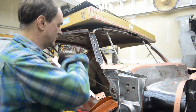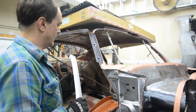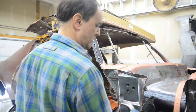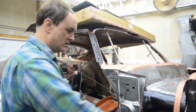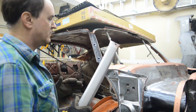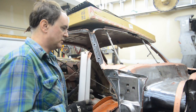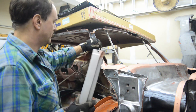I want to clean this up because it's been taking the dash pad off, and I don't know how many times I've been spotting the holes here. But it's nice making progress. This is back on, seam sealed in here, kind of half-assed painted inside with the rust encapsulator just to protect the metal. As soon as I get these on, I can spray the inside after I sand everything with 120 grit to give it some tooth for the paint.